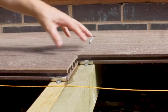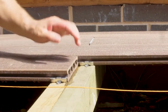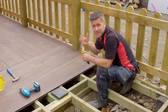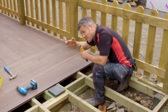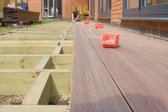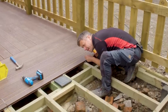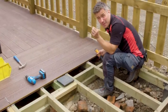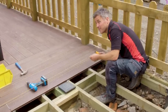I'm creating a brickwork effect by staggering the joints of the planks. Wherever the joints meet, these must be sitting on two joists, leaving a 10mm expansion gap. I would always advise every three courses or so, get yourself a string line and run it from one end to the other, because you can find you've got a fraction of a pull between them. Especially in warm weather, the boards tend to expand and contract. So every three boards I run the string line — I've done it on my third, now on my sixth, and I'll do the same on the ninth board. If you have got a little bit of a defect, you can pull them out or pull them in — it's only about a millimetre or two. What you don't want to do is leave that bow in there, because it'll get exaggerated the more boards you fit.